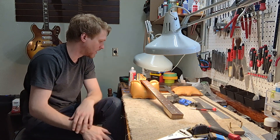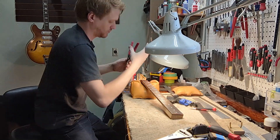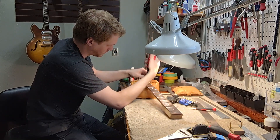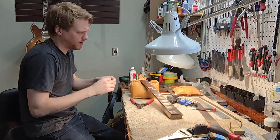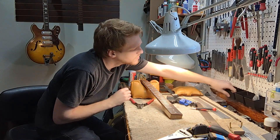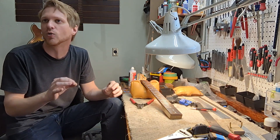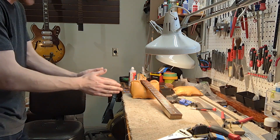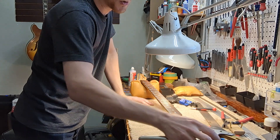I know on the internet there are various camps arguing about perfectly straight necks versus having some relief, although those that claim a little relief is important seem to be winning that argument. Well, they're just dead correct. If you want the neck to have perfectly consistent headroom — you want every note to buzz the same amount — then a little bit of neck relief is necessary. I'm going to get my surrogate Telecaster body, bolt this onto there, so we won't hit Mike's guitar with a sanding beam.